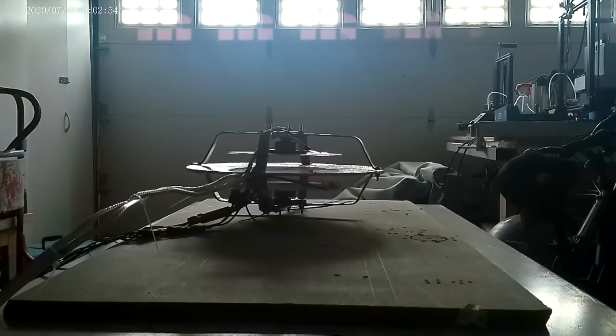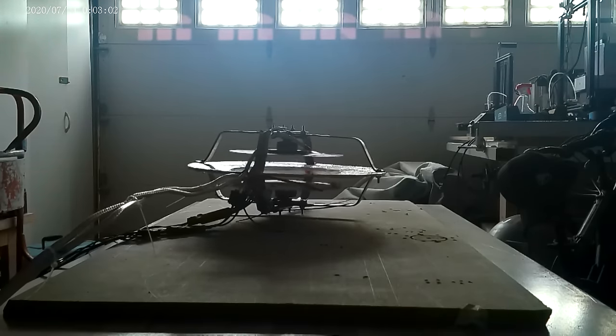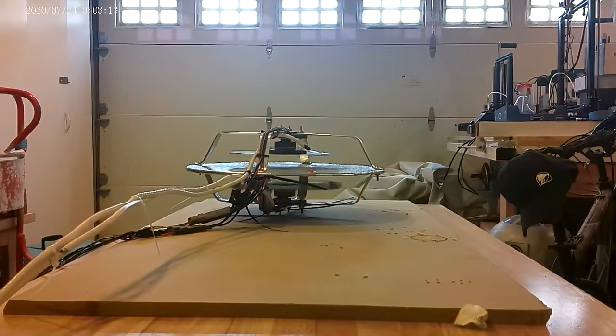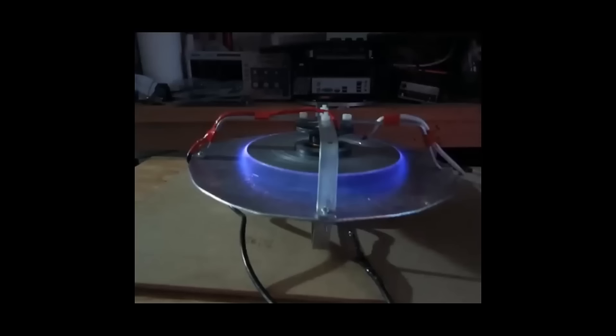This was my first high voltage test — a complete failure. The high voltage took the easiest path to spark, going right into my motor and attracting to any metal bolt in there. To fix the problem of voltage jumping to the bolts, I removed all metal bolts and replaced them with plastic bolts right where the high voltage runs down to the motors. This solved the problem — it no longer arced over to the bolts, and I was able to run quality tests on the high voltage.